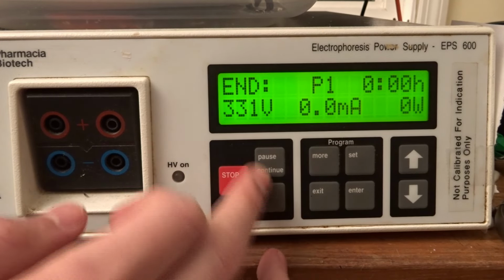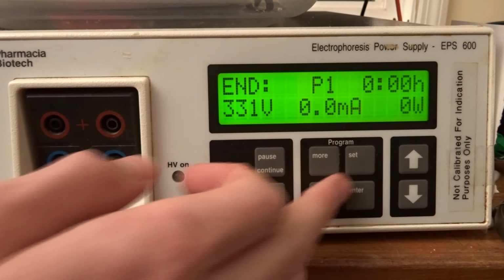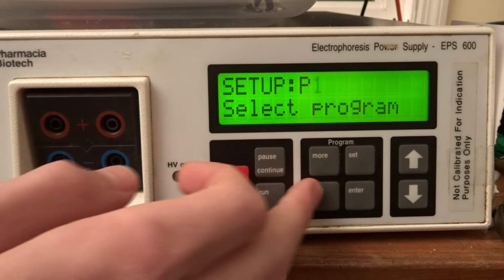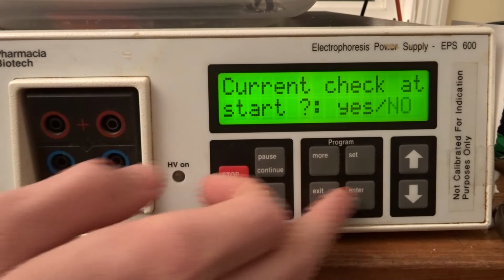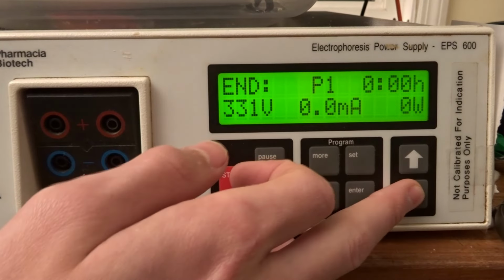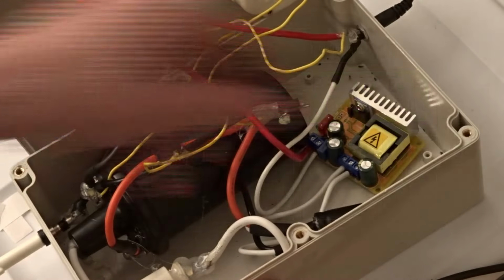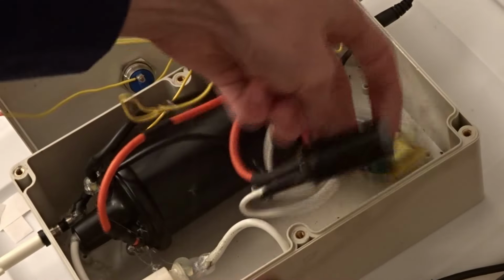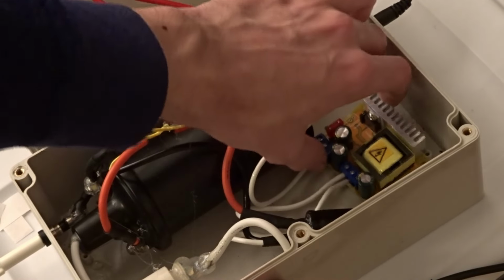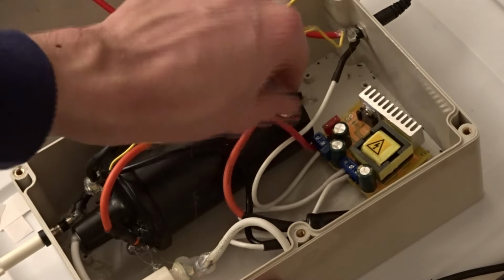And while you could try telling it offensive jokes, a much more efficient scheme has been developed. Essentially what we need to do is send a high voltage pulse to the lamp to start a low resistance path between the electrodes. Then the caps can dump their energy and the tube will flash. This pulse needs to be really high voltage, like tens of kilovolts high. For this lamp, I use a 30 kV pulse, and that seems to be the minimum to get it to fire reliably. To get this pulse, I use this monstrosity, and trust me, it's just as bad as it looks.